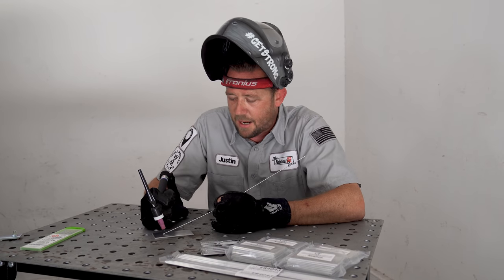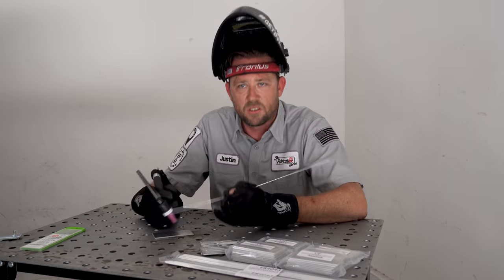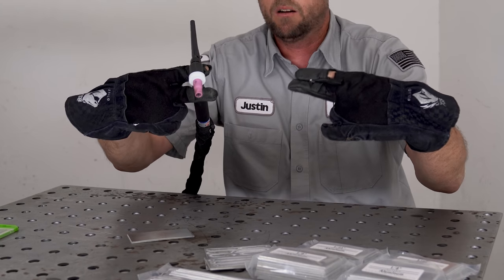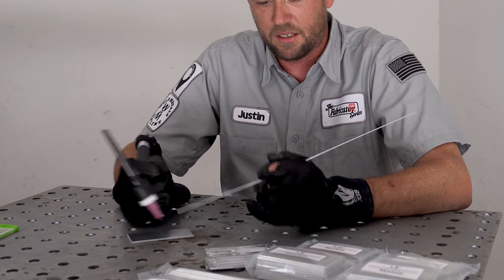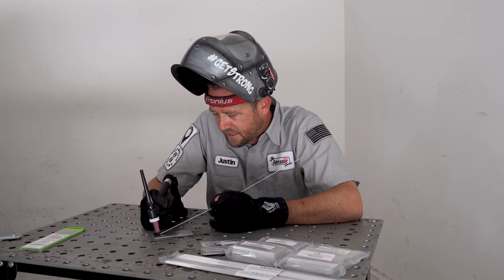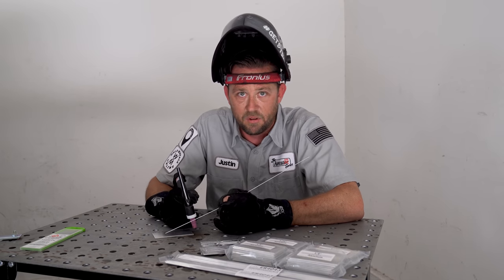Don't lazy-lay wire over the top — that'll halt you. Leading edge, tap it in, bring it back out. All of the movement is in my fingertips. I'm not going to be tensed up. The filler is held the exact same way as the torch — mirrored. Between my middle and index fingers, the rest of it rests on my perlicue, just like the torch hand does. Filler goes here, torch hand goes there — not tensed up. We're just going to create our weld pool and as soon as we have quarter inch or six millimeters, tap that leading edge.